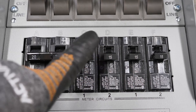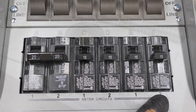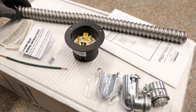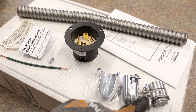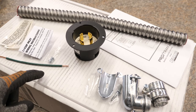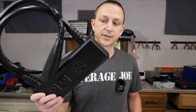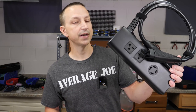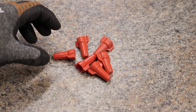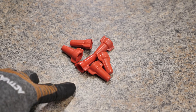That matches up to each one of the circuit breakers on the box, and each one is labeled L1, L2. It also came with everything inside the box: a three-quarter inch flexible conduit about 16 to 18 inches long, a manual, a couple of squeeze connectors, an L14-30 30-amp plug, an extra ground wire, wiring instructions, and some stickers. This kit also came with their double voltage hub — you need this if you want to do 240-volt split phase. And finally, it came with their heavy-duty 10-gauge generator cable. The only thing it did not come with is wire nuts, so make sure you get some of those before you start.